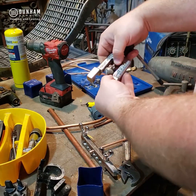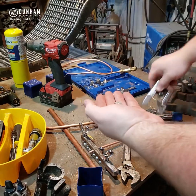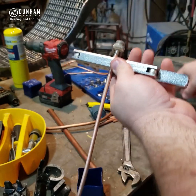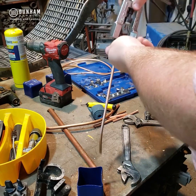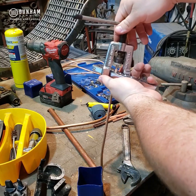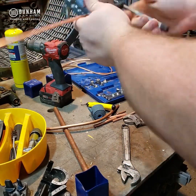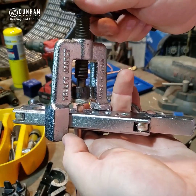Now I'm going to use this yoke here, and I need to replace the tip of it. You can unscrew and take your flaring tip off and get the appropriately sized swedging tip. I know this is the right size because it just barely slips in and doesn't go in. We're going to use the yoke to push this in, so I'll tighten it on the yoke — loosen it just a little so it can lock on, then go ahead and tighten it down.